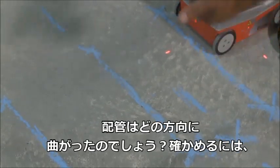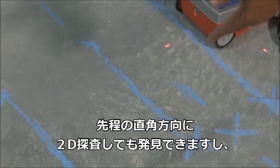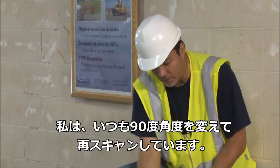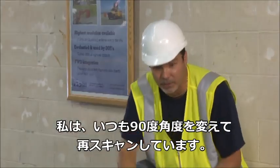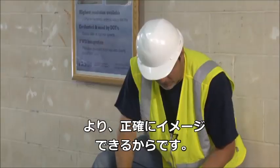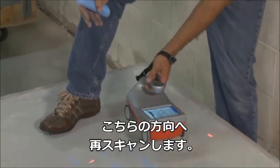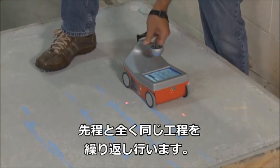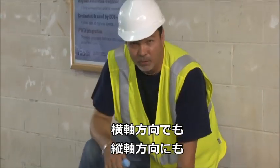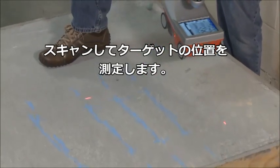If you have questions about that, you can do 3D or re-scan the area to make sure you didn't miss anything. I also want to repeat the process going perpendicular — the 90-degree direction. The reason is that I found all the targets running one way, but now I need to scan the other direction. I roll my wheel forward to get blank data, go in that direction, mark out where hyperbolas are, move three, four, five, six inches over, do the same process, and connect the X's. Now I can find targets running both ways.